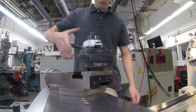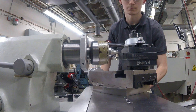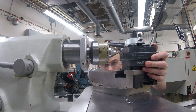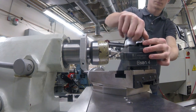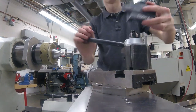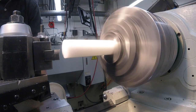Now I'm putting my cutting tool in the tool post, throwing the live center in the tail stock, and bringing the tip of my cutting tool and the tip of the live center together, then looking at it from the front to see whether or not the tip of my cutting tool is at the right position. Once it was, I locked it down and tightened that jam nut so it wouldn't move around on me when I was changing tools later. Then I pulled the tool out, put it on the correct side, and started the machine up.